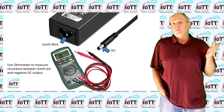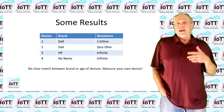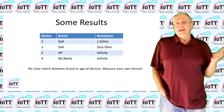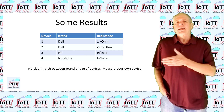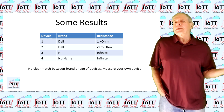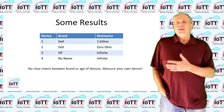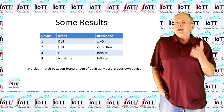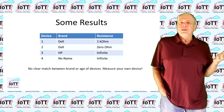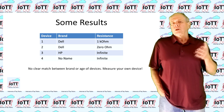I went through some of mine and found 3 different versions. I have some that have a firm connection between the negative DC pole and ground. Then I have some that have an infinite resistance, meaning the output voltage is floating and can assume any potential in reference to Earth. And then I found some that have a 1K resistance between the Earth pin and the negative DC output, so sort of a loose coupling.